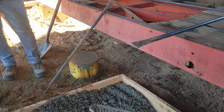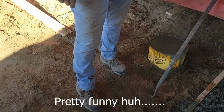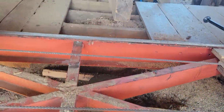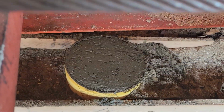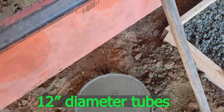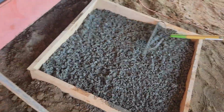What we've got is we put piers in here. There's a pier here, a pier there. We have a pair of piers, and this will have an I-beam on top of it right here, which goes to there. They are deep enough to meet code, 30 inches deep. We'll put the I-beam under it. Life will be good. And there was steps here, but there was so much sawdust under these steps, we couldn't even see it.